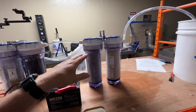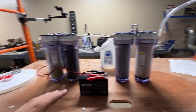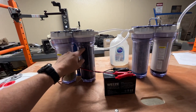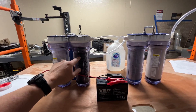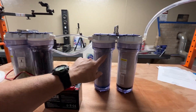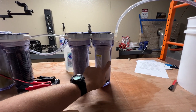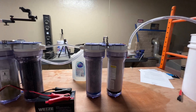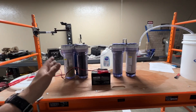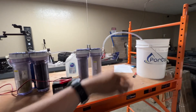The expansion pack is pretty cool — it gives you another housing unit and two additional filters. Right now I've got a sediment filter, then a carbon wrap whole house filter. These are just basic two-and-a-half by ten whole house filters. Then I've got an activated carbon powder filter and a Sterasyl ceramic filter. This setup would be great for filtering really nasty water.